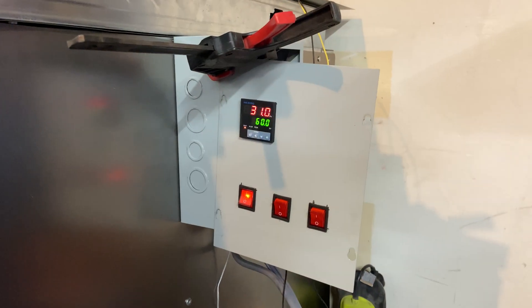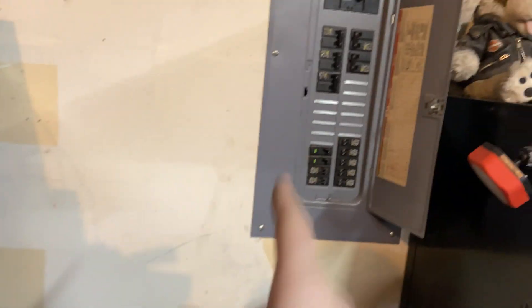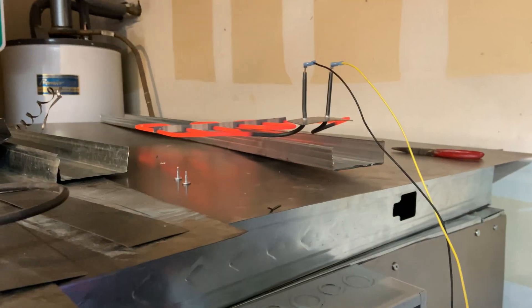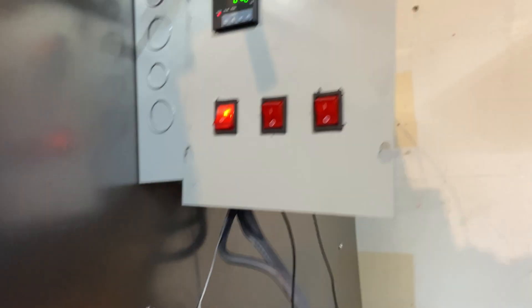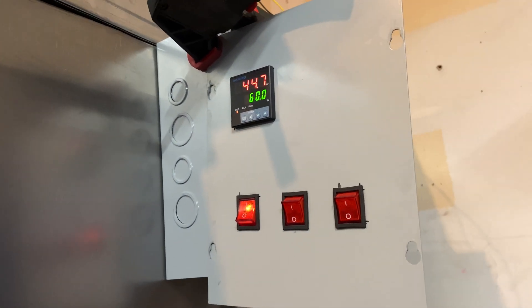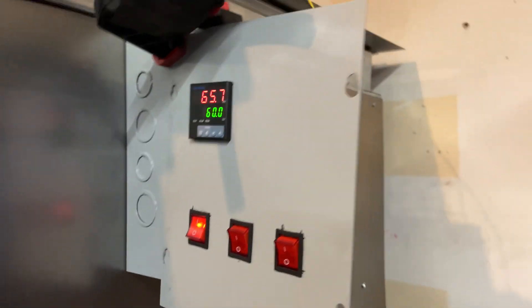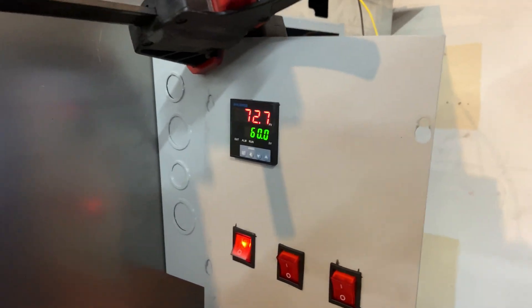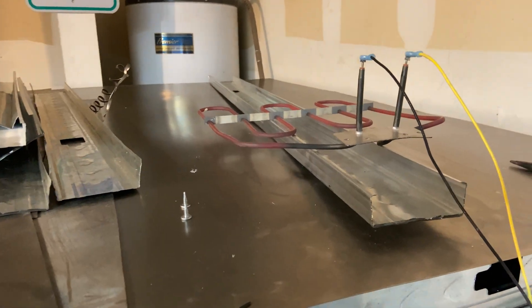I'm going to do a quick demonstration. You can see we got our control box wired up — just doing a test function right now. We have a breaker and everything. When that red light is on, that means it is sending power to the relays that are powering this heating element — you can see it's getting red hot. That is the temperature the thermocouple is reading right down there, and that is the temperature it's set to — 60 degrees. So whenever I hit the thermocouple with the heat gun, you'll see the top temperature start to rise. Then you can see that light flipped off — look at the relays, none of the red lights are on and the heating element is already starting to turn down.